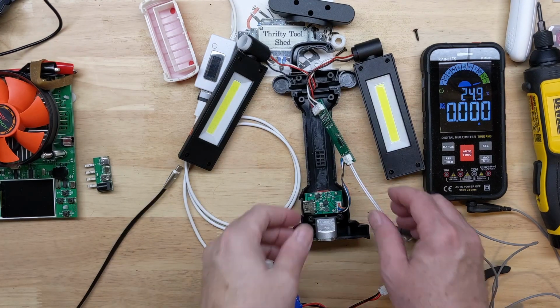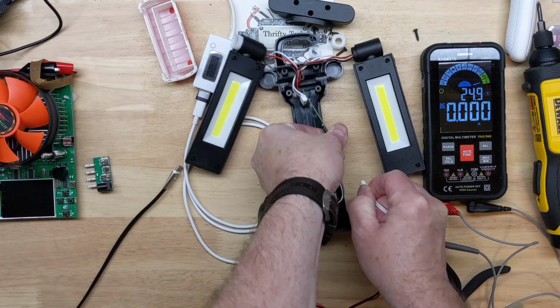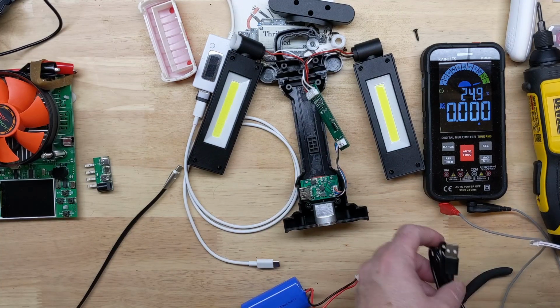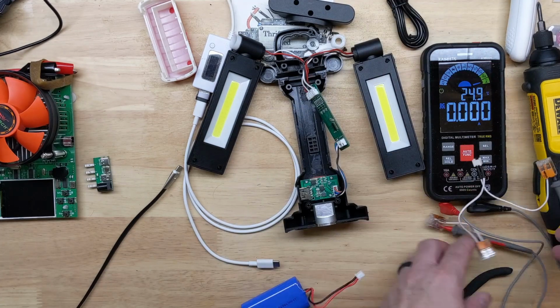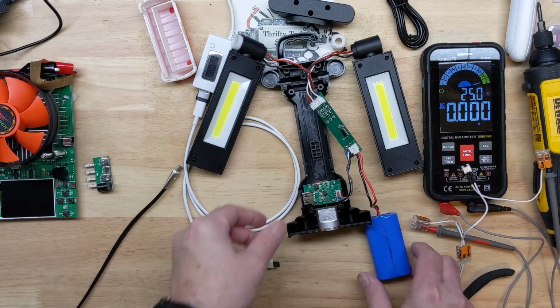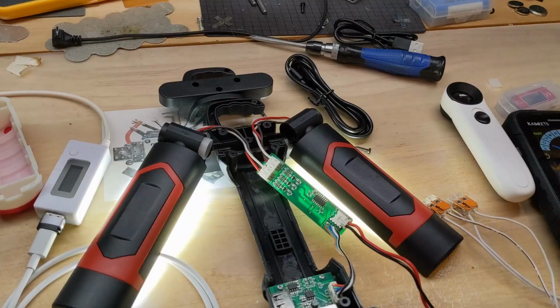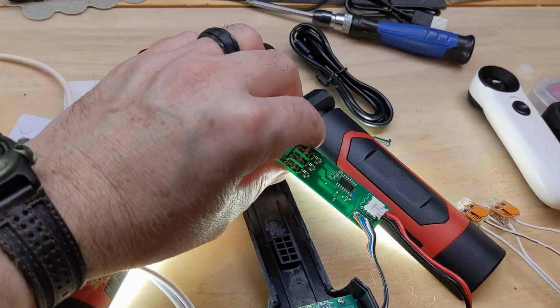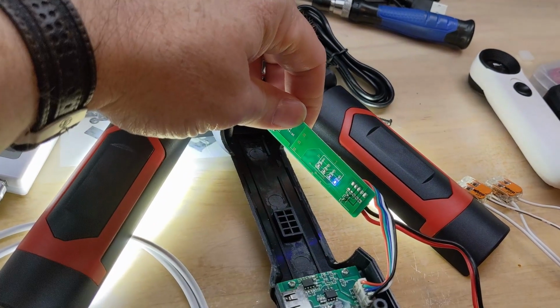So that means when we first cut it on, we can get about 6.4 hours of use out of that mode. The second mode, where they're both on but dim, was 0.18, so that will be 24 hours. And then the spotlight is about 500 milliamps, so you're talking about basically 8.4 hours, so that's pretty good.